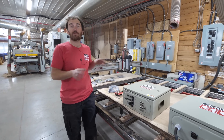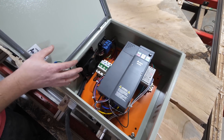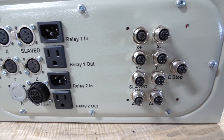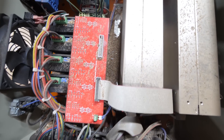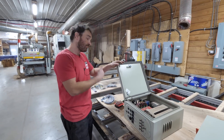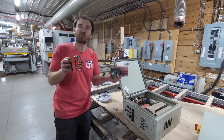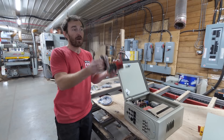The next step is the control boxes. This spindle comes with a brand new one — it has a VFD in here which is going to control turning on and off the spindle as well as the RPM. A cable connects the new spindle control box to our original control box where the XYZ motors, network cable, proximity sensors, and zeroing doohickey plug in. I opened it up and this thing is full of sawdust — I don't open it up often enough. We never really had a hiccup though, so we're getting it cleaned out. We mounted a new board for both boxes. Avid has upgraded their circuit boards for better efficiency, and they sent along two new circuit boards with the new spindle, so we're changing those out and then hooking all the wires back up.